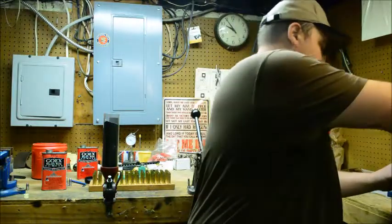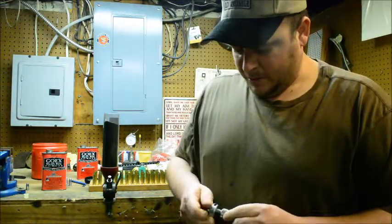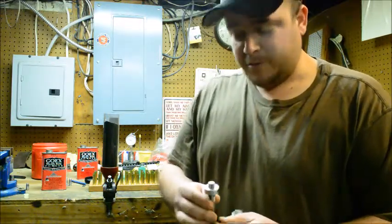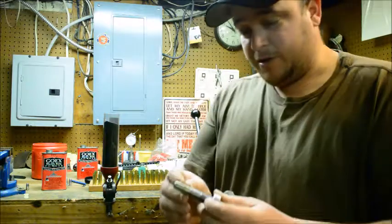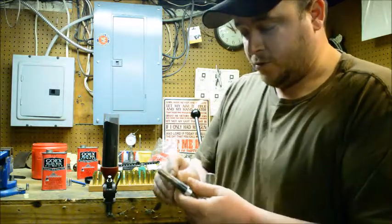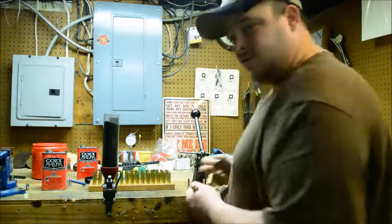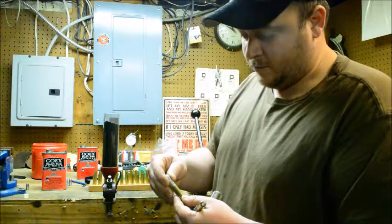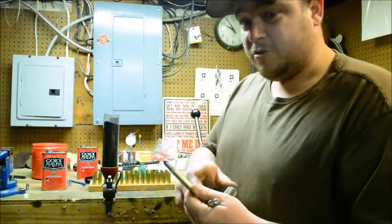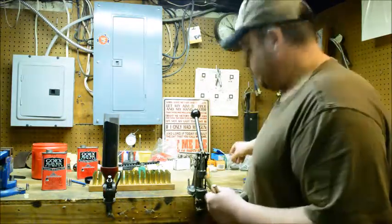This over here, I've got reloading dies. Now, this old doohickey right here, I think this is really what makes it. This is a custom expander die that Buffalo Arms makes. It's a 460 in the base, which right here expands the brass to 460, and then at the mouth it goes to 464, right there. So that allows you to slip the projectile into the case without shaving any of it off. And then the 460 will give you enough neck tension that when we charge these cases and get them ready, you can just thumb seat them, but there'll be enough pressure on it that you can turn it upside down and they will not fall out.